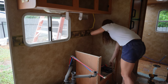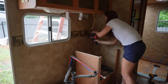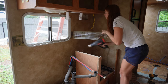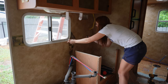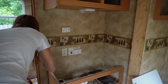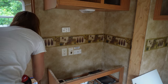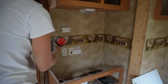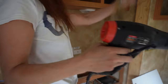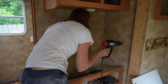I'll let that dry and move on to removing these borders right here. Anytime you're going to renovate an RV, you're going to come in contact with these borders, and I would highly suggest removing them. But if you just pull them off the wall, it's going to leave a trail of adhesive, and you don't want that because it's almost impossible to get the adhesive off the wall unless you use Goo Gone or something, and then you leave a gooey residue. My trick is you get a little heat gun, put just a little bit of heat for just a few seconds, and you kind of just pick it up and peel it as you heat it. The whole thing will come off - it's super easy and leaves no adhesive residue. Highly recommend doing this - don't try to peel it off without any heat.